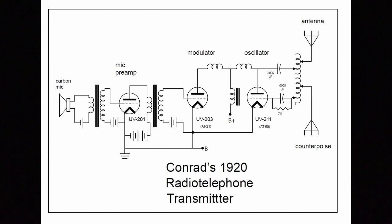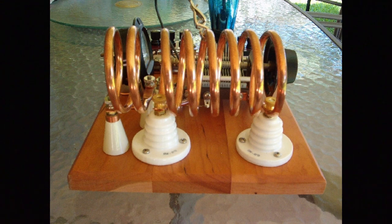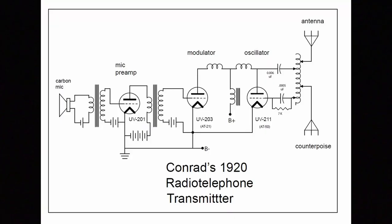So they had a lot of issues, but the thing to keep in mind is transmitters draw a lot of current. And as such, the components in it are pretty hefty. Typically, they use a copper pipe for the output coil, and they had to because everything else in it is pretty robust. To achieve that kind of current draw on the tubes, a lot of times they put the tubes in parallel with each other in order to allow more current to pass through the circuits. Now, the antenna on this thing was actually kind of interesting. It was six runs, 90 foot long, with 20 foot spreaders. And this thing was 210 feet up in the air. It was between buildings.